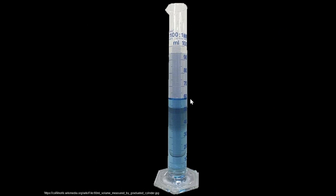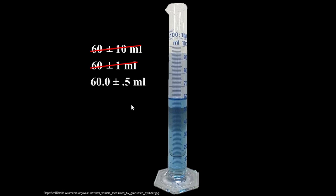If you had a graduated cylinder and look at it, you might say that's 60 milliliters. If you write down 60 milliliters, that's your last non-zero digit — you'd be implying give or take 10. We can do better than that; we can clearly see it's not down at 50 or up at 70. I would say 60.0, give or take 0.5 milliliters — that's half the smallest division, since the smallest division here is ones.